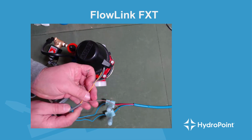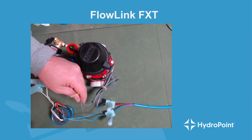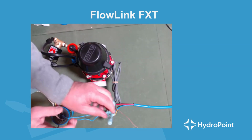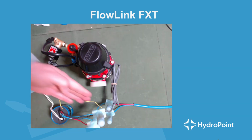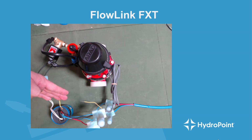And notice with the photodiode flow sensor, I've got three wires: a bare copper, a translucent wire cover, and a yellow wire cover. Following the wire diagram, I know that the black wire goes to the bare copper, the red goes to the translucent wire, leaving us just the yellow wire from the photodiode and the yellow wire from the FXT.